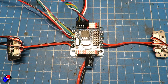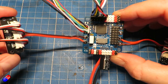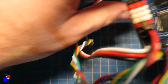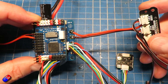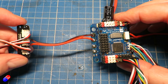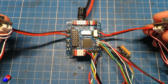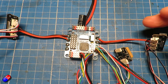The next job was to solder each of the power cables from those wing root connection blocks into the power pads on the flight controller. I've used the flight controller pads that are towards the front. I want to leave the one closest to the tail so that I can solder that into the tail pieces. I did make sure I was laying it out on the bench so that the right connection pod was on the right side, and I also made sure to leave that rear set of power connections free for the tail ESC.